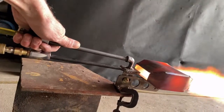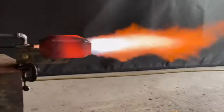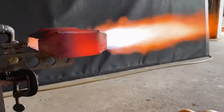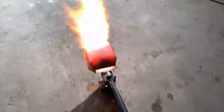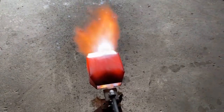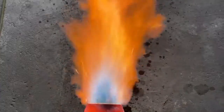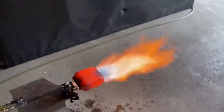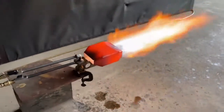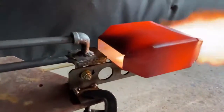Here's another look at me adjusting the angle of the flame to make it come out of the burner straight. Very cool nozzle. We can fix this geometry issue — this is not a showstopper at all. I'm still in awe of the simplicity of this nozzle. Making a wide flame has so many applications. Spreading out that thermal energy into a flat fan is definitely going to have some benefits in a lot of situations.